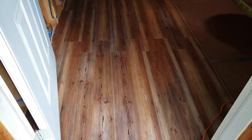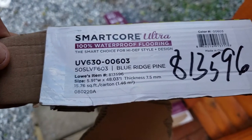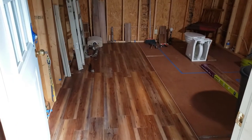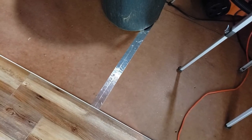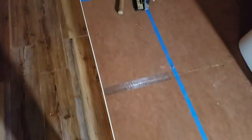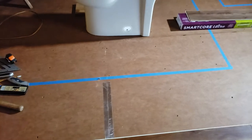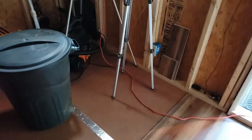There's my flooring and it is called Blue Ridge Pine from Lowe's. Really good stuff, really durable. You don't have to put a backing down, but you can if you want extra cushioning and extra insulation. I've put aluminum tape down all over the seams — it's got a little felt backing — just so nothing comes in and covers the gaps. This cabin floor is really, really square. I'm really surprised. This is Amish built.